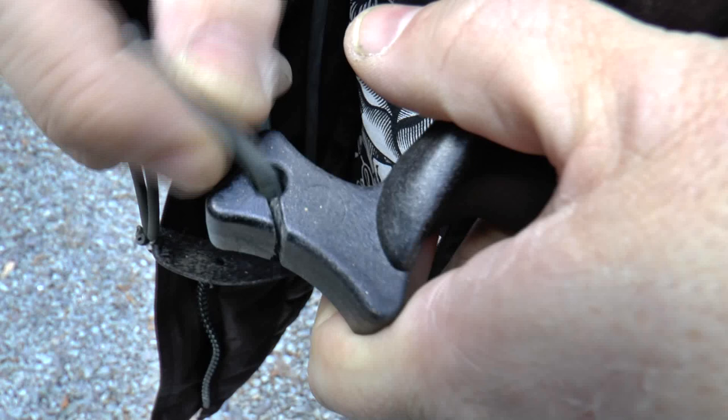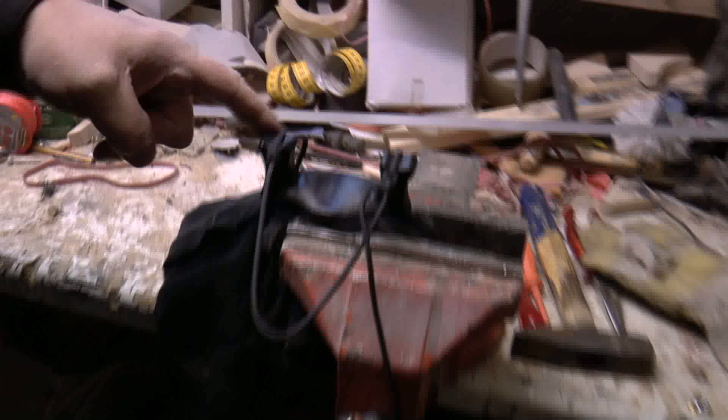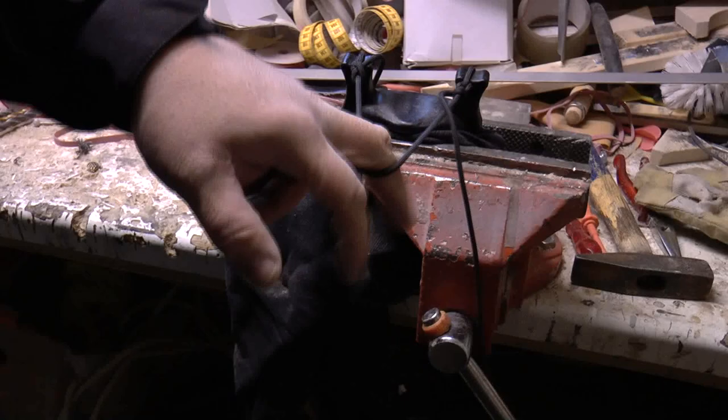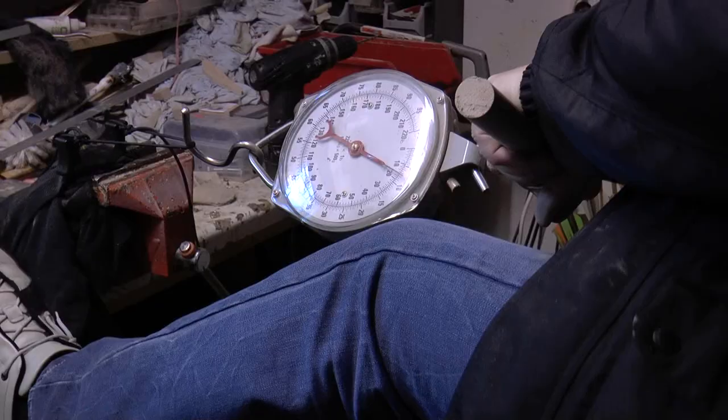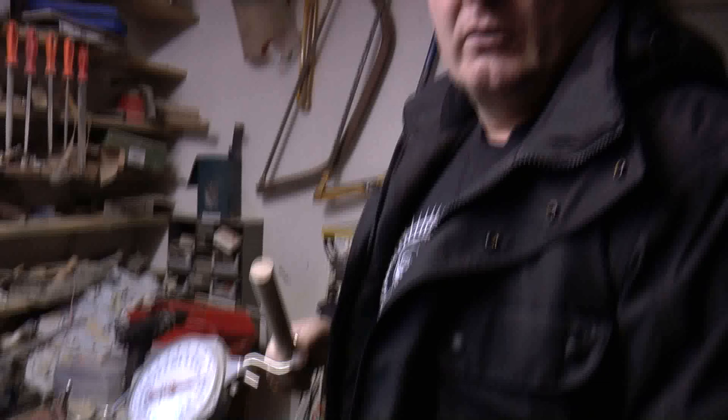Here you can see that I cut through the slot so I can easily exchange the bands. This slingshot is made of plastic, so we need to test if it's really strong enough for our toughest bands. We clamped it into a vise and attached rope instead of rubber. The strongest bands I shoot have 18 kilograms of draw resistance, so we need to make sure it holds at least twice that — 36 kilograms. It was over 100 kilograms and it didn't budge. If you could draw bands like that, come and work for me.